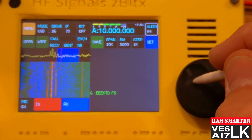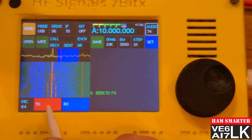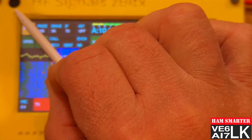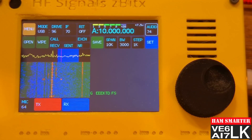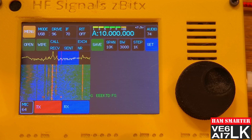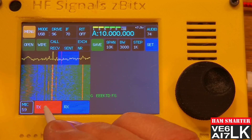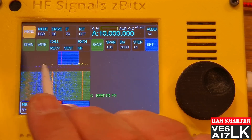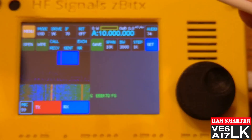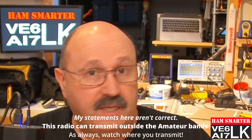I'll turn the audio down and show you a couple of other things. I'm clearly outside of the amateur bands, and the menu has changed to a simple TX and RX. In phone mode, this little black thing in the corner is the built-in microphone — it's an electret element and it's actually reasonably sensitive. You can turn the drive up with the mic control, but if you turn it up too much you'll see some distortion. I'm out of band, so I'll show you two things at once: I say transmit, my drive is all the way up, and you can see my voice on the spectrum display — but I am not putting out any power. The radio prevents you from transmitting outside of the band even though it looks like it's transmitting. It won't let you, so that's a good thing.